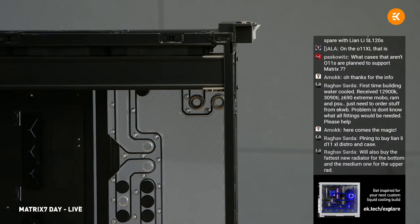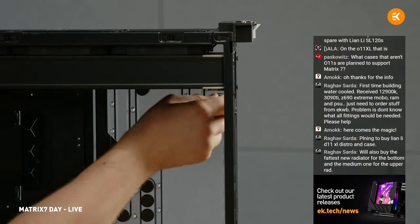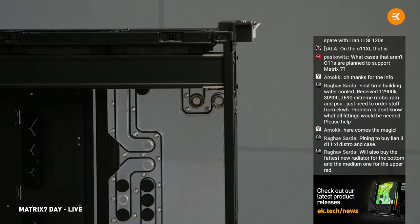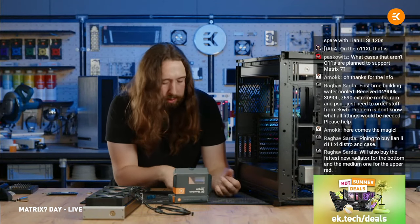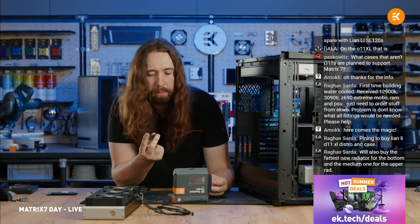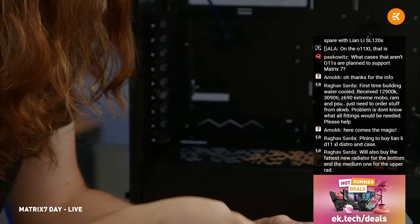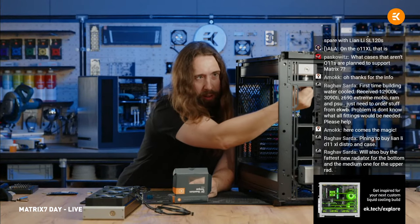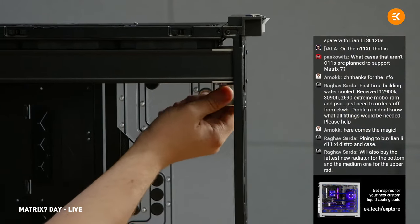And with the trusty loop key and the larger of the two sides, we'll get those in. Don't go too tight with fittings in flexi. Just enough is all you need. Don't go getting a full length Allen key. This little guy, the reason they sometimes break is if you're tightening things too hard. They break not for their own weakness, but because you're being too hard on them.